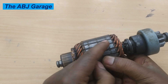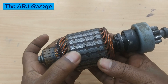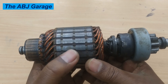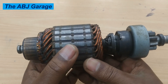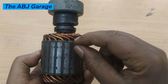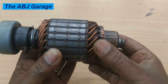All the wires are interconnected and insulated from each other, so they are only interconnected through the winding. These electrical wires are also insulated from the armature iron core. The iron core is a laminated iron piece in order to minimize eddy current — an unwanted circulating current generated by metal exposure to magnetism. To prevent overheating, the iron core is laminated, meaning it is made up of a stack of small iron sheets, which increases resistance to eddy current.